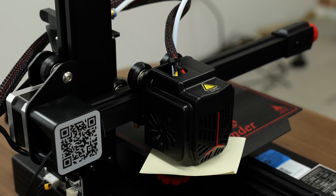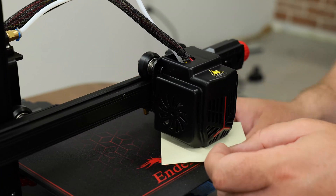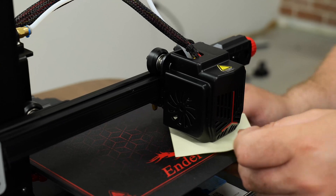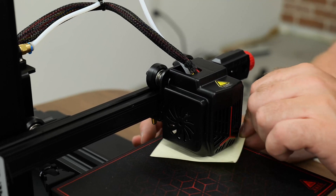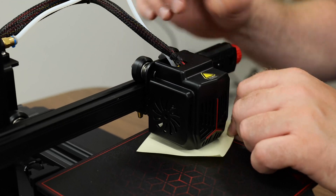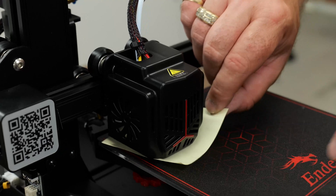We'll move around to all the other corners. Moving to the next corner — if you look, it's completely loose now, so we don't want that. We're going to go clockwise to bring that spring up until we've got that drag. We'll move the bed, then the next spring — too loose, we'll move that up until we get some drag. There we go — too much though, so I'll back it off until I get the perfect amount of drag. You want to repeat this process — maybe go around three or four times. You can also move into the middle of the bed a little bit to get a really good overall bed level.